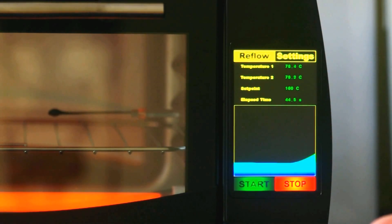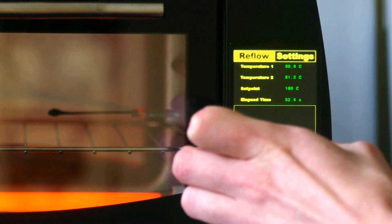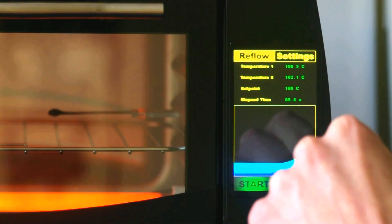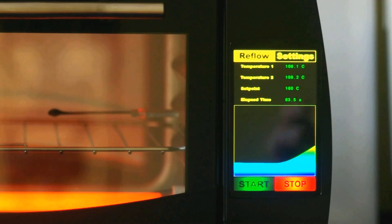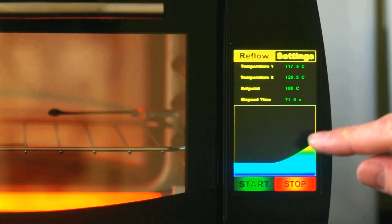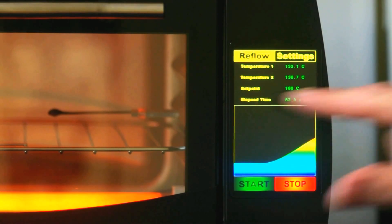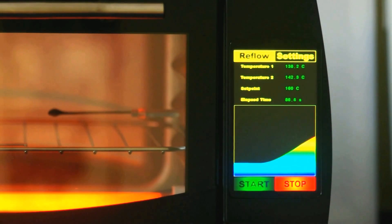When I get the RTC interrupt, I jump to my painting function, shift my array with new data, then format this bitmap with a color map. I have a one-line bitmap, and because I know the temperature I can apply that bitmap color to that exact point. I'm using a double while loop to fill the SRAM with colors. With 800 by 400 points that's a lot of data — internal SRAM cannot handle this, so I'm using external SRAM. As you can see, the color mapping looks very good.